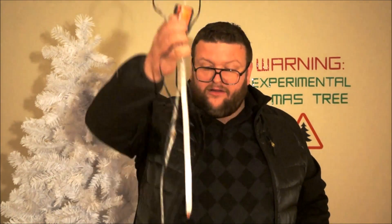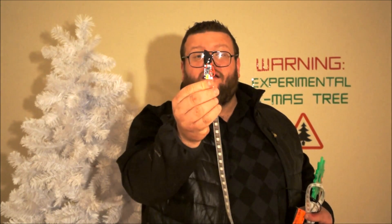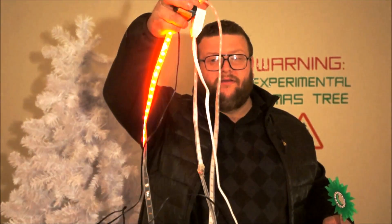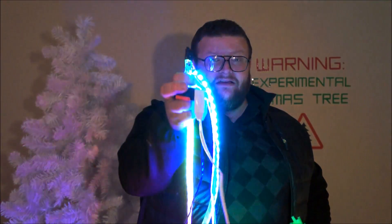Here's some of the stuff I built to go on the tree — right now we're looking at lighting. I've got 2 meters of NeoPixel strip. I took a Trinket microcontroller — to give you an idea of how small these are — and it builds right into the end of the NeoPixel strip and provides all the control for about 120 LEDs. I can plug it into my computer and change the animation. I also found an AC brick at the thrift store to handle the power requirements. It takes a second for the Arduino to boot up, then it starts going through an animation. All this lighting goes in the trunk of the tree and fades out, providing super bright color effects instead of string lights.